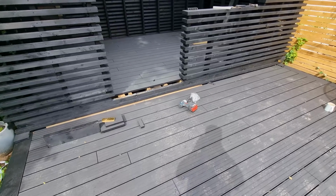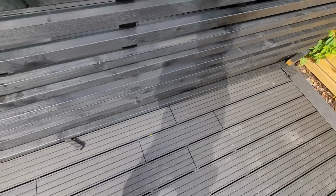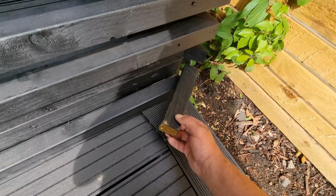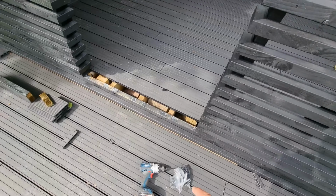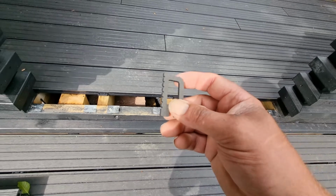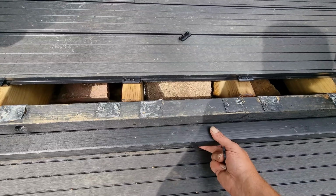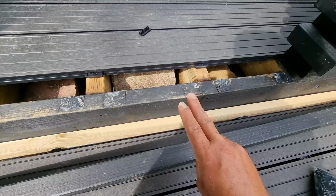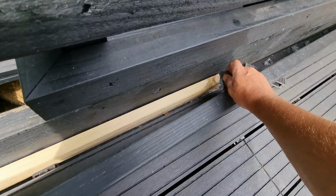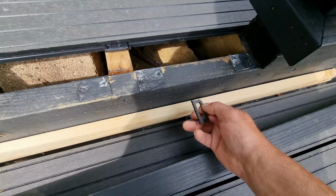Right, a quick update. That's where that last timber, that last batten goes. And you see if it's sat on that piece of offcut, it's about the right height. So that'll go there. But there's that ugly gap under there. I was going to rip a board down, but to keep the integrity of it, see, that's just a piece off like that. Keep the integrity, I'd have to keep that little piece in, otherwise these are two loose pieces, but that don't fit, it's too wide, so I'd have to cut it back here.